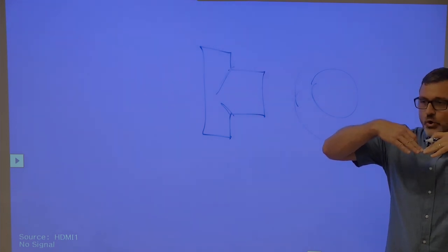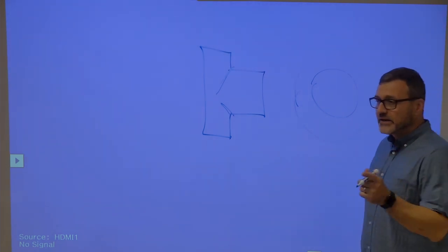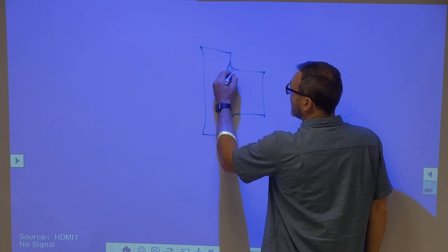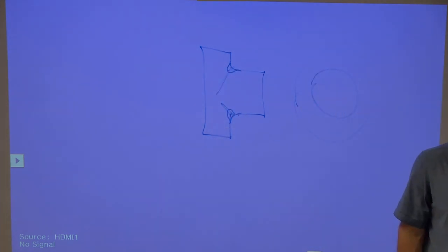It's a joint that invites cracking. So if I'm going to do something like that, oftentimes I will radius the corner here, or I will undercut the corner here so I can have a radius in there. If I have a sharp corner, I'm almost always inviting a crack to happen. If I've got $500 or $600 invested in this thing, and I send it out to heat treat, and it comes back cracked, I'm going to start all over again. And so, time and money. I want to pay attention to those kinds of things.